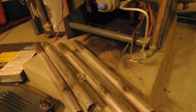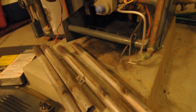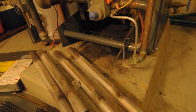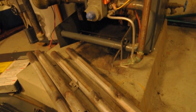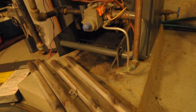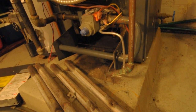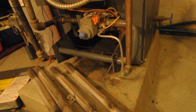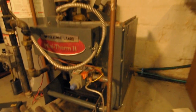You should be able to clean these and put them back in. But if they're fouled, that is usually an indication that your heat exchanger also needs some cleaning too. In an extreme situation, you could have a lack of flow through and incomplete burning. You could even have exhaust gases come into the unit because they're not flowing through your heat exchanger properly and getting up into your exhaust.